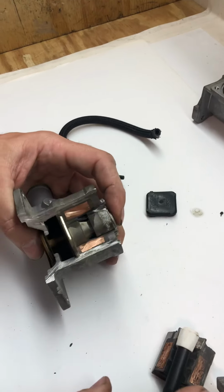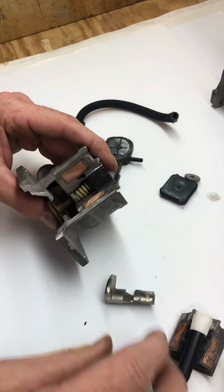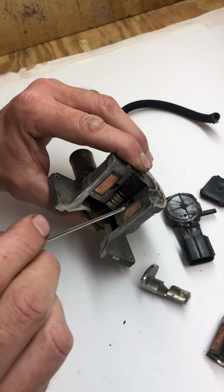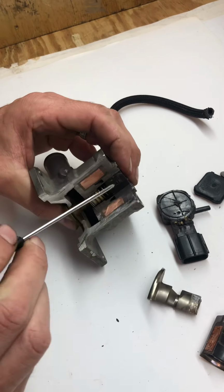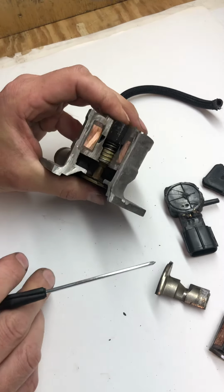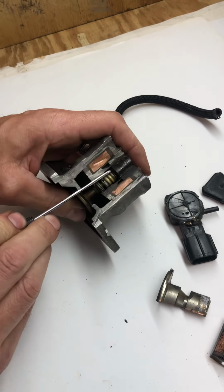down. So if you dissected it a little further, this is what's on the inside, and this was all gunked up also. When these two wires here energize the magnet, this difference here on this plunger, this is a magnetic differential material, pushes down, okay? And that right there, folks, is what gets jammed and gets stopped up. You can take this apart further if you like.